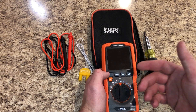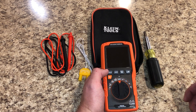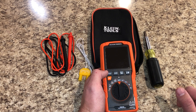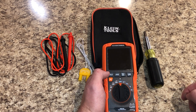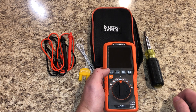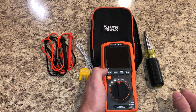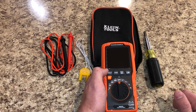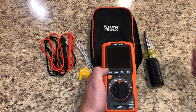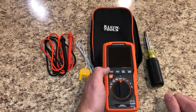It does current up to 10 amps, volts AC and volts DC naturally. It has a beep test incorporated with the resistance test, and it actually measures resistance all the way up to 50 megaohms, which is pretty impressive. It also does diode test — really helpful when troubleshooting inverter boards on mini splits and VRV systems — plus capacitance and frequency.